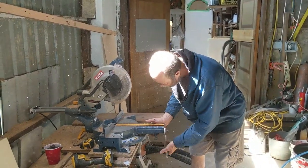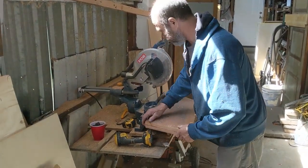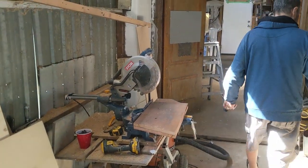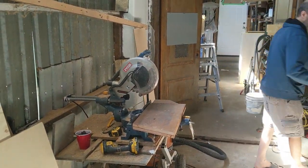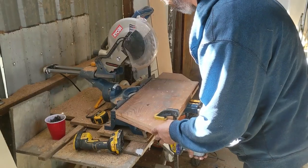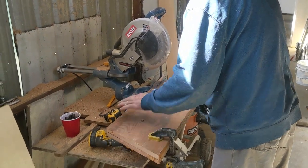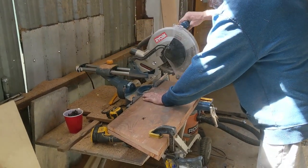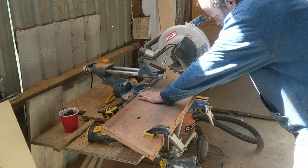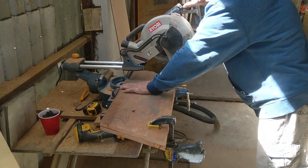I have a straight cut in there and I want it nice and straight. I don't want it to move — to keep the same size, I'm just gonna use one of the stops. You can put everything straight in there, that way it gives me a square line. You can see here it's a little bit out of square. Cut both of them at the same time, that way I have them all the same size.